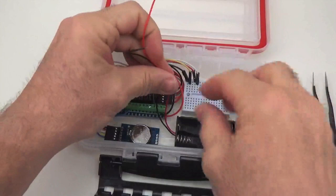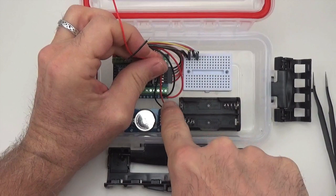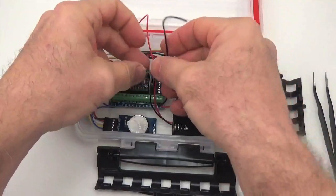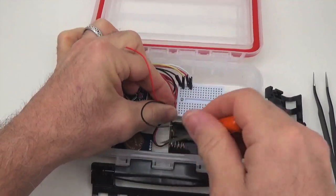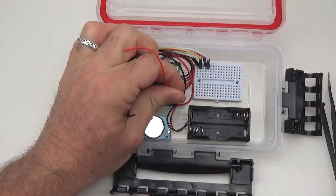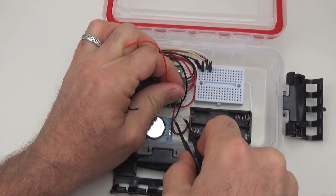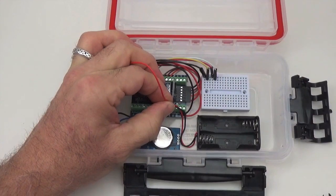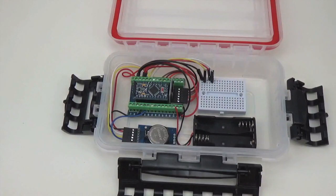And these battery connections are literally just going to go to these jumpers that we brought down when we were putting the power on the SD card, so they just go here and get cut. And you see how I'm folding that down a little. Experience tells me always leave yourself some extra cable. If it doesn't hurt the design or the build in any way, give yourself the opportunity to repair a mistake by leaving a little bit of extra cable before you trim.